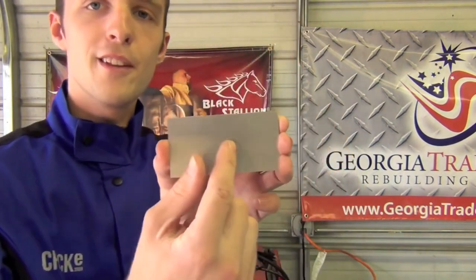Aluminum is a really good conductor of heat and electricity - it conducts heat about six times faster than steel. This is why you'll hear people say a machine is capable of three-sixteenths inch steel but only one-eighth inch aluminum. Aluminum acts as a heat sink, meaning when you're welding, heat gets sucked away from the weld area out to the rest of the piece much faster than with steel. That's why you commonly use more amps when welding eighth-inch aluminum than welding eighth-inch steel.